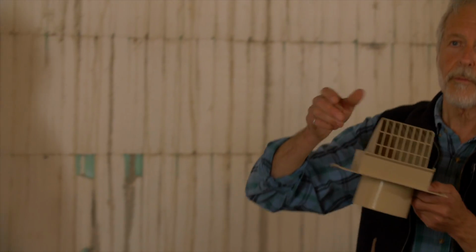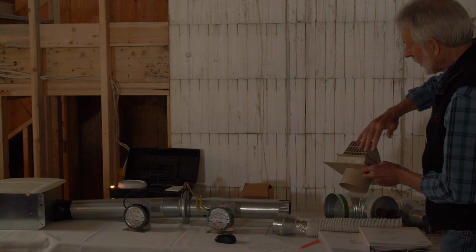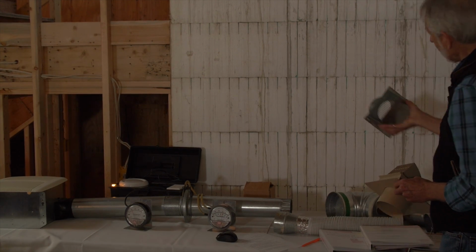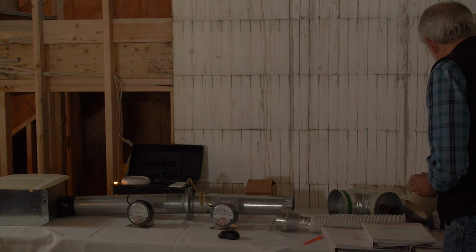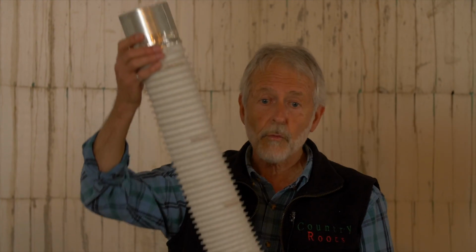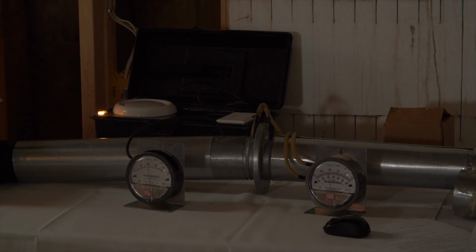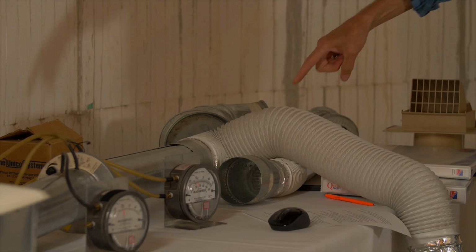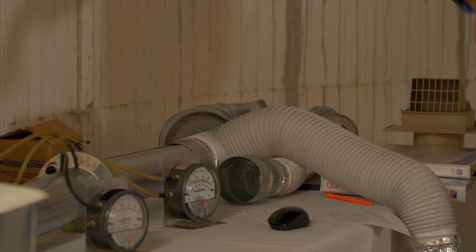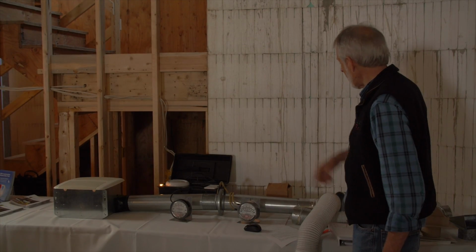Not only are these good for the building enclosure and rain screen, these are definitely freer, with the screen across the bigger opening area than this with a screen right across that 4-inch diameter. It starts to get really bad though when you start doing this, because flex is actually equivalent to only 3-inch diameter, this 4-inch flex, and that's why this is no longer allowed by the building code for any application. And this is only 3 feet of it, but now we're down around 11. So we took a horrendous beating, and this isn't with this put right on the discharge of the fan. If you put this on the discharge of the fan, we can't measure it because it's complicated to measure, but it's a heck of a lot more detrimental.